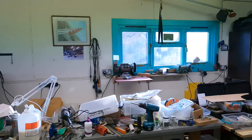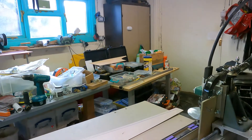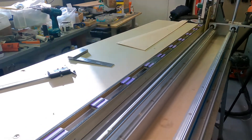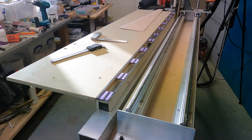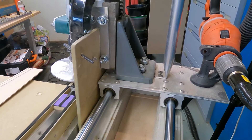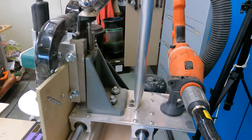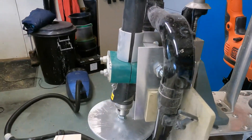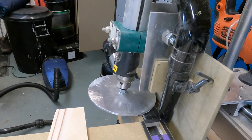This was my wood machinist's approach to the problem and I produced something which works very effectively — judge for yourself, but here it is. It basically consists of two parallel rails with a saddle that fits on them, carrying a drill that drives a disc on the front with a sanding pad on it.